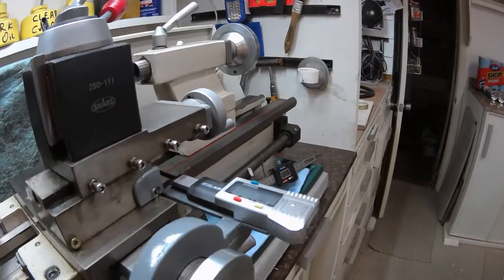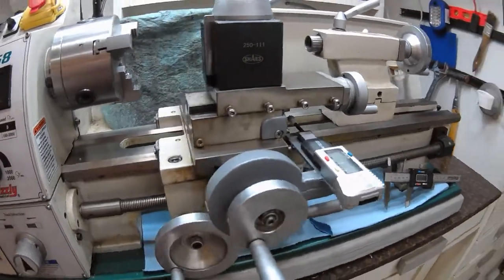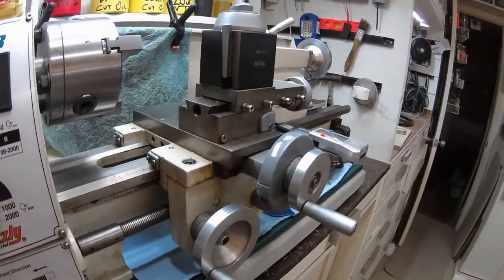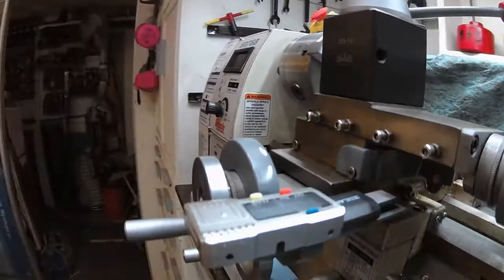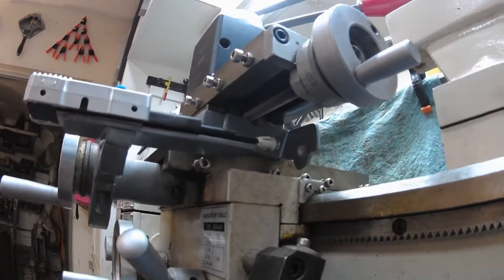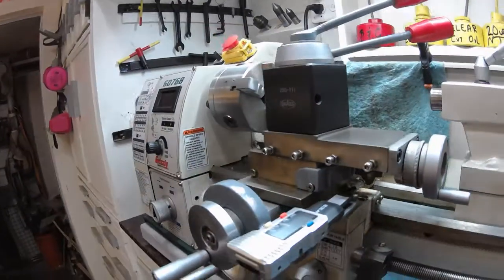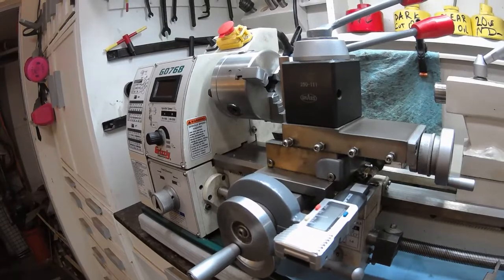What I've done is simply made a couple of aluminum brackets that encapsulate the stem of the cross slide with a little table. Then there's another bracket in the back with a rare earth magnet. It goes underneath the compound and it's attached with a screw hole that was used for a little plastic protractor that I never used.